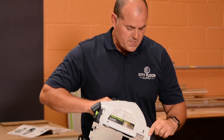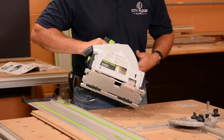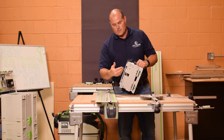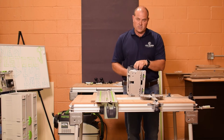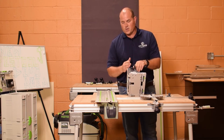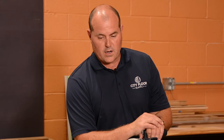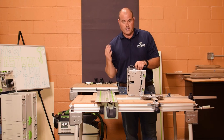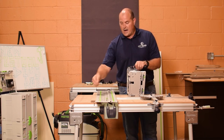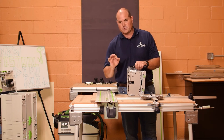If you notice this little window here on the side, it comes out very easily. What does that give us? We're about to put in a splinter-free guide. For anyone that's run any of the saws from Festool — to get splinter-free, you want to have a base underneath and also on top, and that allows for zero chip out. So if you are cutting with the grain instead of cross grain, and you could normally get tear out — particularly on plywood, but even on wood such as oak — to stop that, we can put in a splinter guard that's supplied with the saw. You would cut into it to create a zero clearance, and now with your track and your cutting edge, you get absolutely zero splintering.